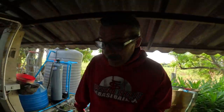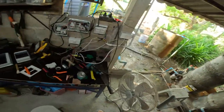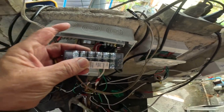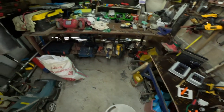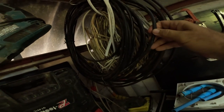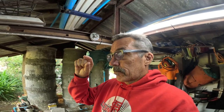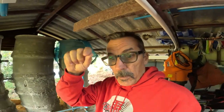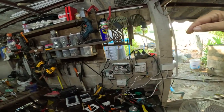Speaking of bus bars, that's the design, right? I was actually surprised that the hardware stores didn't have them. This one is actually bigger than these, but you've got this big thick line, like a number 3 gauge, or even number 2. That big metal can't fit into those little guys, so they have a simple brass block adapter. You stick it in that, and the adapter has a little footer, which is usually smaller, and the footer can go into the bus bar hole.